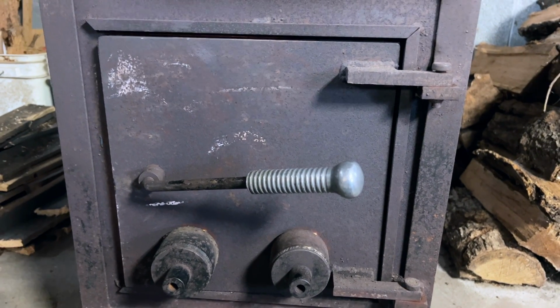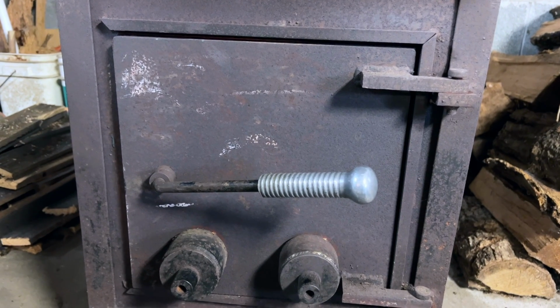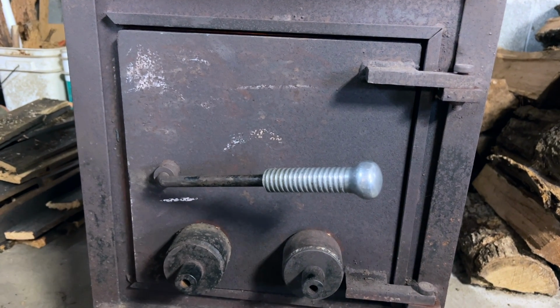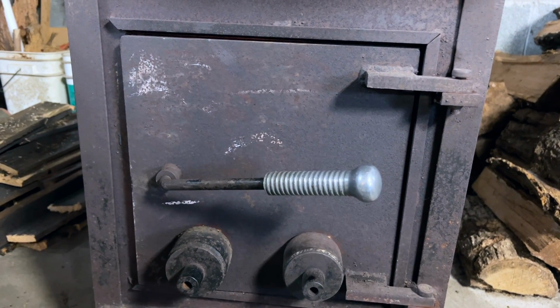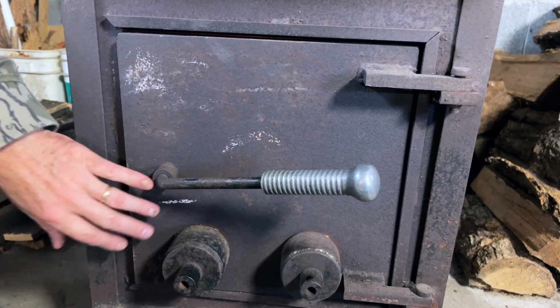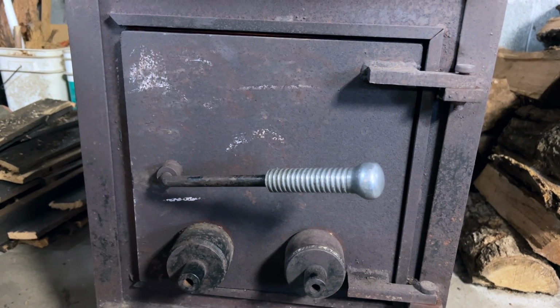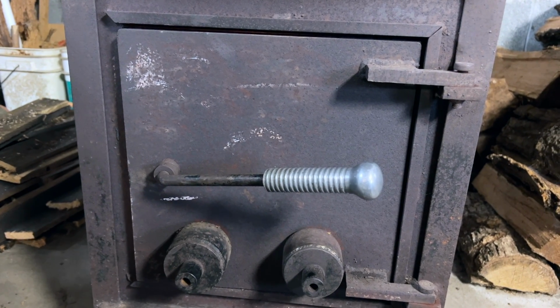And that noise sounds a little bit like a freight train. I don't know if you can hear it or not, but that's the draw of this air coming. It's drawing from the top of the chimney, drawing the air out of the basement through these dampers and creating a suction. That's the sound that you hear. It's pulling that oxygen in there to burn the fire.